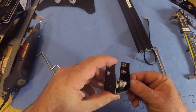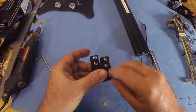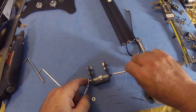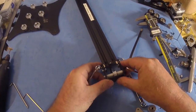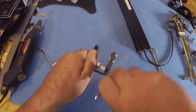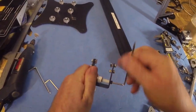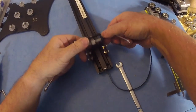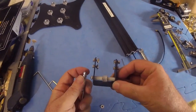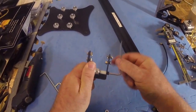I wasn't trying to rush this video — I would have that little washer in there, but I can put that in there anytime. When you put these on, do not over-tighten, because all you're going to do is compress the little U-shaped bent metal here to the point where it doesn't want to slip on easy if you go too far. So just be careful — see, right now I've gone too far and it doesn't want to go where it's supposed to. Even when tight, I still have plenty of rolling room. If you see how much play that has, that's one of the reasons why I like putting that little washer in there. Let me loosen that back up.